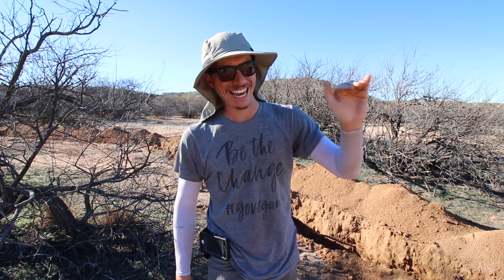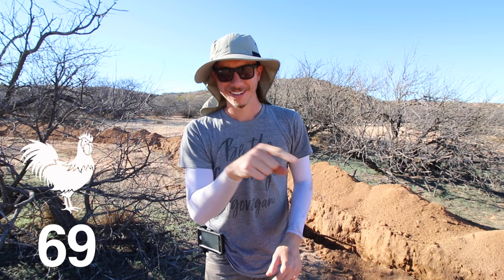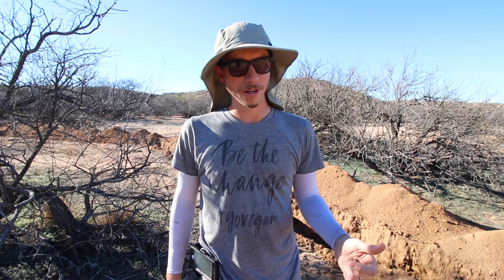And what I'm also going to do, the 90s going into the tank, I'm probably going to run a little bead of caulk all the way around. Then once the 4-inch lines are run up to the gutters, which we're getting on the 24th, and I believe today is the 21st, then we can hook them up, and then we'll be rainwater harvesting.